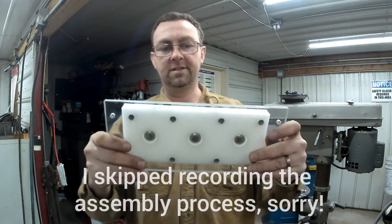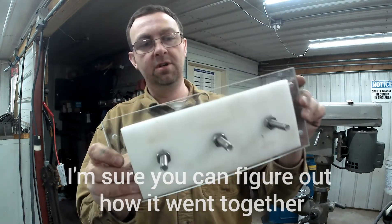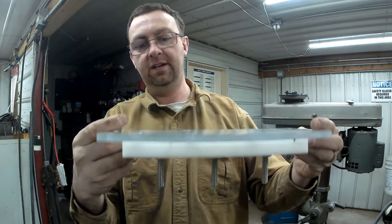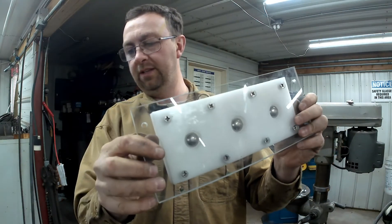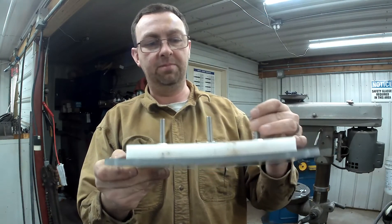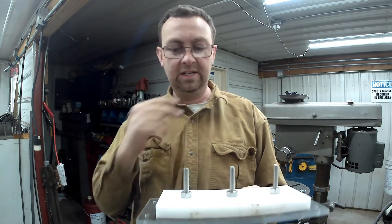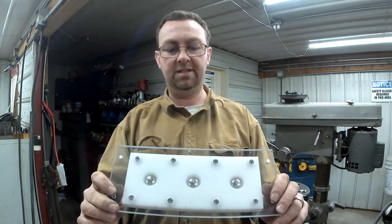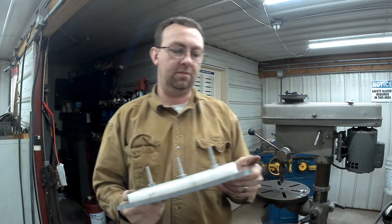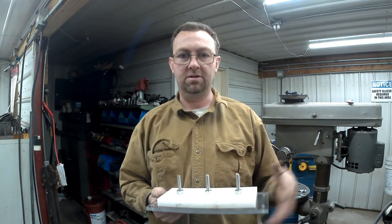Here it is — the first of the eleven I'm going to do: three-phase terminal bus bars, fully insulated, for the Mark Twain Zephyr. These get mounted on the outside of the car, the HEP power gets terminated on each one, and leads come off for the transformers plus the jumper lead car to car. Pretty simple and basic, and it'll work just fine. I'm going to try to post a link to the Mark Twain Zephyr in the description below.